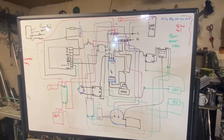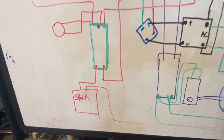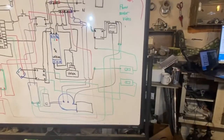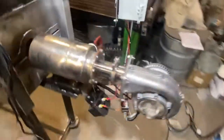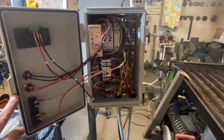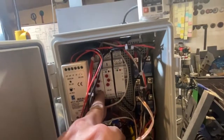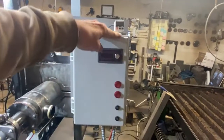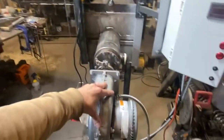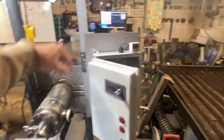For personal archive — this is where we're at. Hopefully I'll be able to see it all. This is essentially everything in the box behind us — it took all this stuff just to light a furnace. Kind of a rat's nest, I'm not done yet, still got to tether everything down. I need to calibrate the timing on the spark igniter — the valve's already set — and I need to label my buttons. This pressure transducer will sense whether or not the blower has died.